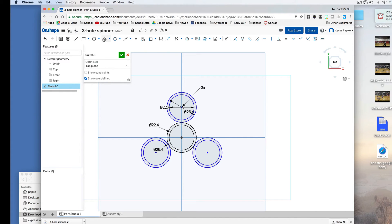Now I'm going to use the arc tool. I'm going to click somewhere here, somewhere here, and somewhere here to draw an arc for the body shape. Then when I use my circular pattern and click it, it's going to put three of them around — it takes this arc and duplicates it to the other positions. I press the left-click arrow on my mouse to confirm. There it is.